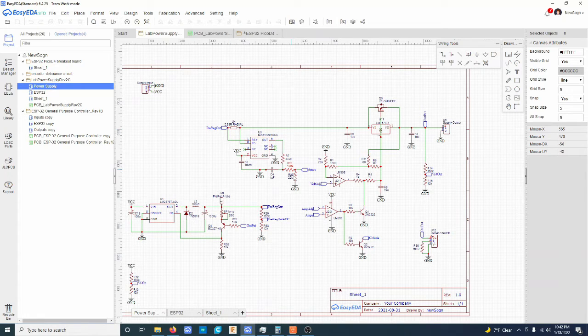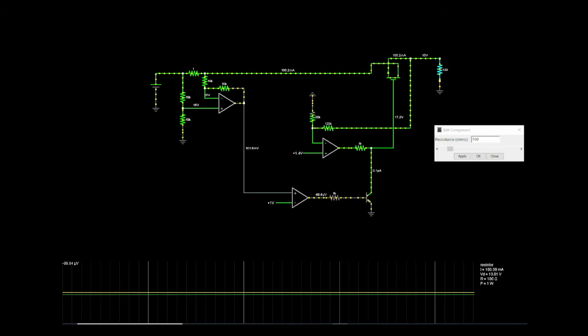And then that goes down into here, into this op amp, which is basically just a comparator. And what we're doing is we're comparing between the amps and the amp adjust, that's basically just the set pin, basically. So that's going to be 0 to 3 volts to dictate what we want to set it to, 0 to 3 amps. So this range is pretty important.